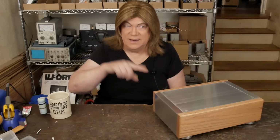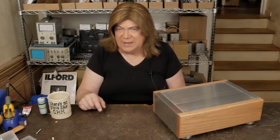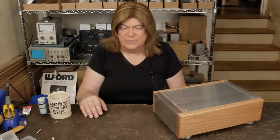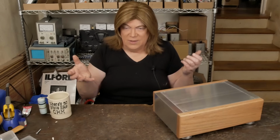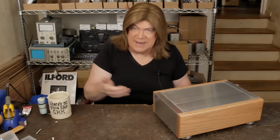He's sending me a couple of these transformers. I think I'm going to go ahead and tell him to go on making a couple of chokes. And I'm not sure what output transformers I'll use. Probably going to use some ISOs, but I'm not sure yet. And if I'm building monoblocks, I probably should just use the big dog ones and not mess around with that. But on the power supply, we should be able to get the cost reduced where these things wouldn't be just insanely expensive.